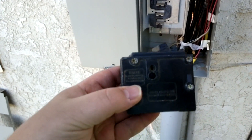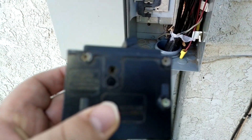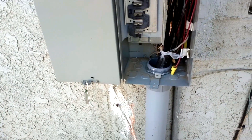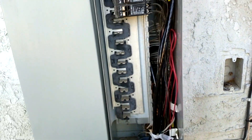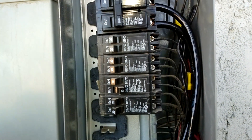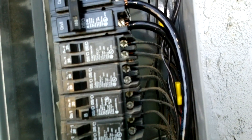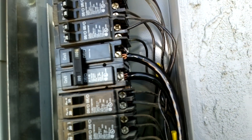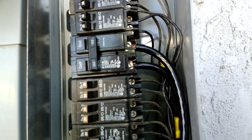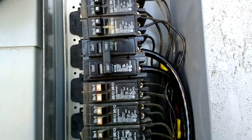The thing about these breakers — on the side they have a torque rating giving you wire sizes and inch-pounds to torque down. For this number two wiring they wanted something like 30 to 40 inch-pounds — pretty big. With only a slotted screwdriver slot I tightened as much as I could; never did hit that click at 45 inch-pounds, but I didn't want to strip the screws or break anything.